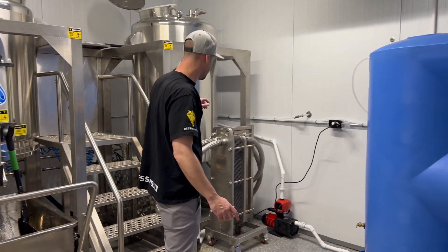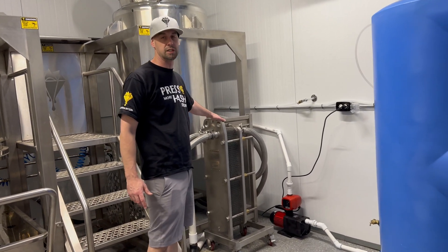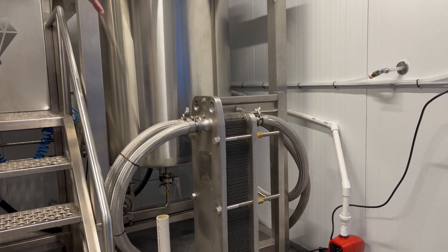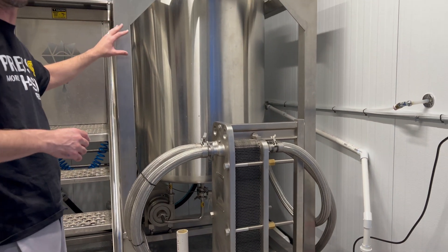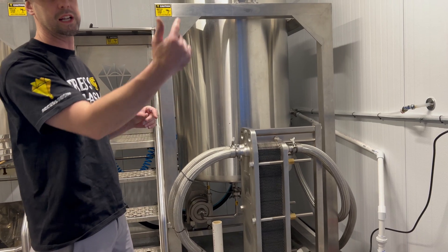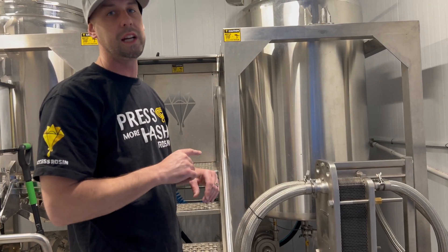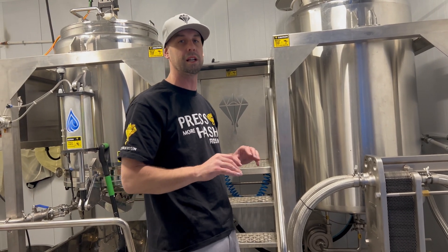We upgraded the whole system with a five-meter square heat exchanger. We're going to recirculate the water continuously in our cold double-jacketed polyurethane-injected tank, making sure that water induced at 60-70 degrees is cooled to 32 in a very short, timely manner — about 20 minutes flat.